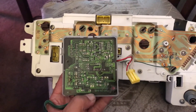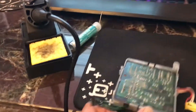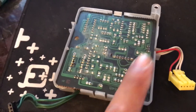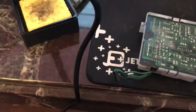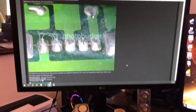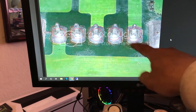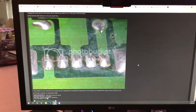It's not as hard as you think. Once you have it out, you pop it off, and this is the board right here. I just reflowed it — you can see I have my solder setup out. I basically just went through and reflowed all the joints. There's an article that shows how these little round cracks, or micro-fractures, form.